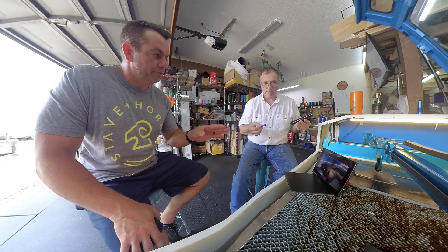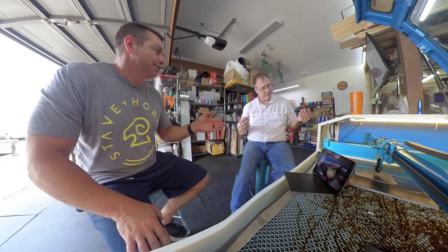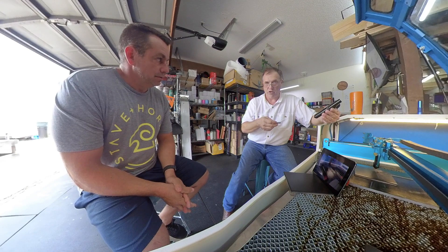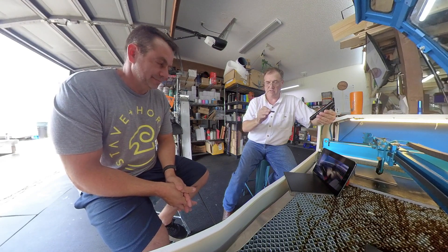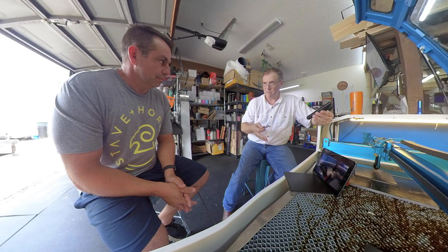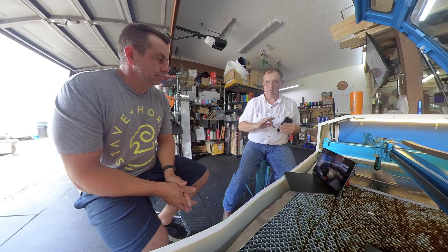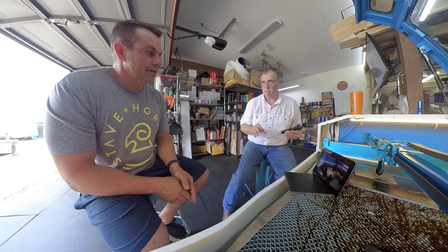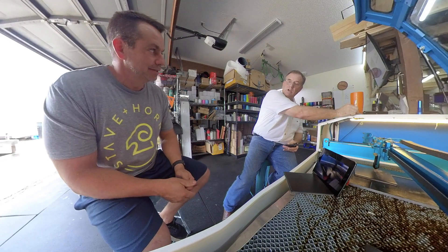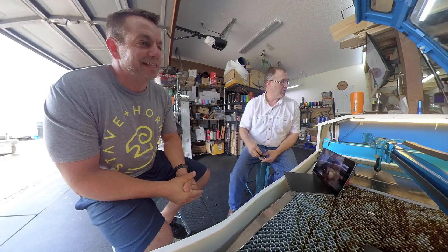The focus distance I've designed is 10.5 millimeters — the same diameter as a triple-A battery. So what you're saying is that regardless of whether it's the 1.5-inch lens or the 4-inch lens, you use the same focus tool — a triple-A battery. We're all based off that triple-A battery, and that's all you need. That will save a lot of time. With my lenses you don't need four different focus tools — you know where the focal point is plus or minus 6 thousandths.